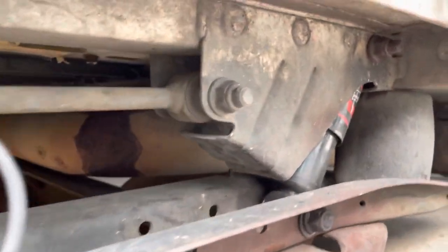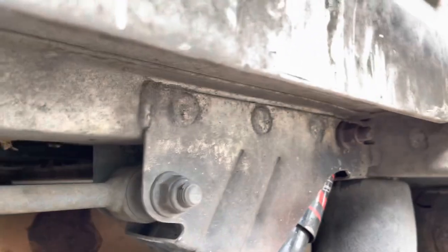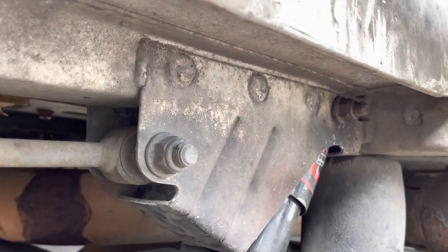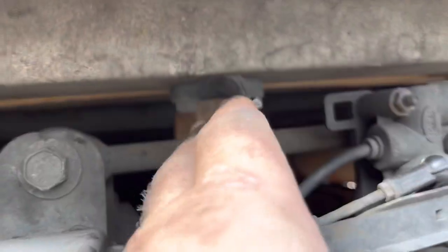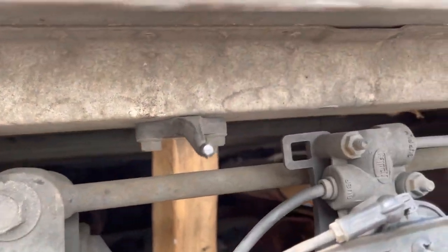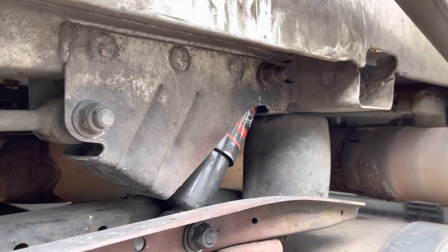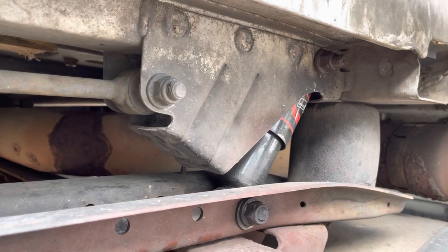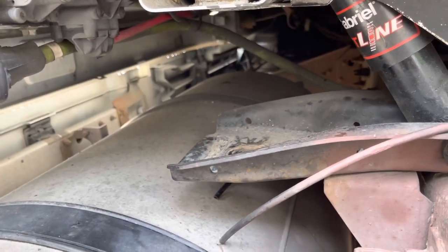I also have to do something about that cabling because it's shifted to the right. So I'll probably have to remove that bolt and drill a hole a little bit to the right into the top to make that bar shorter, or I'll have to cut a piece out — maybe a quarter inch — and weld it together. I'll do either one so my cap won't lean.